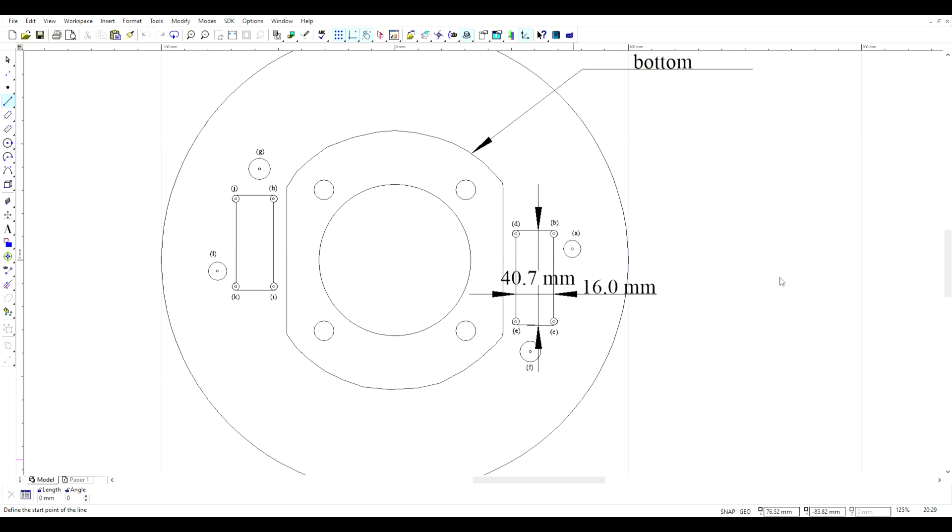Here's the template I made up for the front brakes — I've not machined them yet. Front brakes are an awful lot simpler. You do however have these fixing holes for the cylinders, and these are pretty critical — the holes relative to the cutout are very, very critical. If you don't get that right you'll end up filing it, but I haven't made these yet.